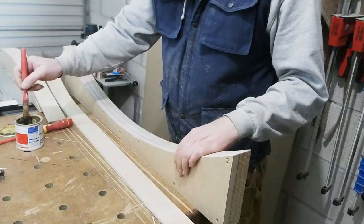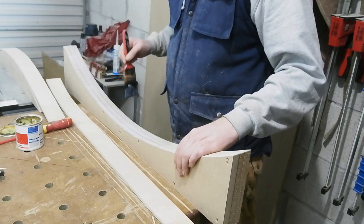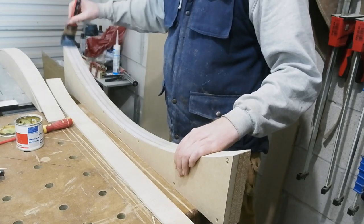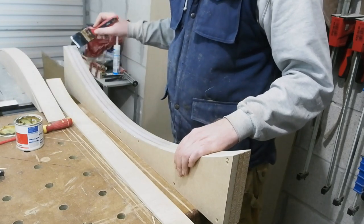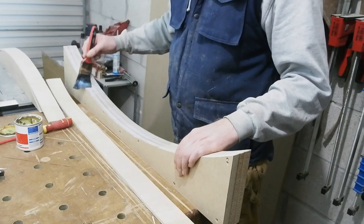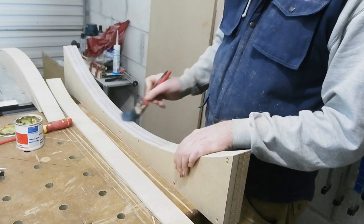Back to the task at hand. I do a preliminary lashing of glue on the MDF face edges to seal them up a bit. The reason I'm adding the bendy ply strips is its outer layers are quite soft — has a little give in it, feels a little bit like balsa wood actually. I just find laying something over the top of the form with a bit of give allows for any minor inconsistencies in the material or through movement while clamping. Cork is popular for this too, and in a pinch even two or three layers of duct tape will do the same thing.